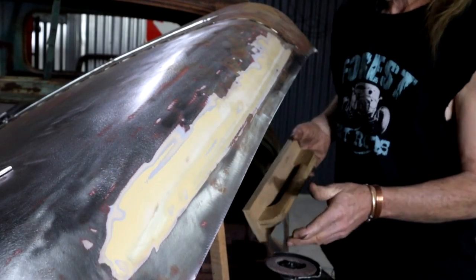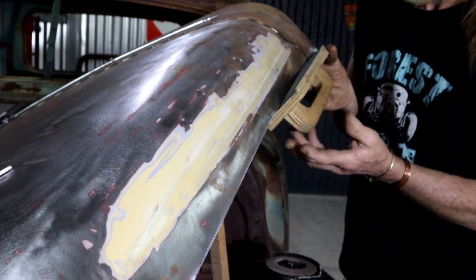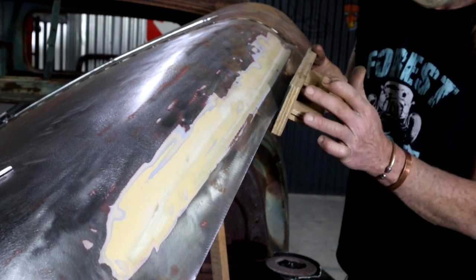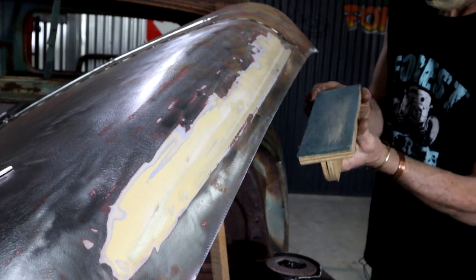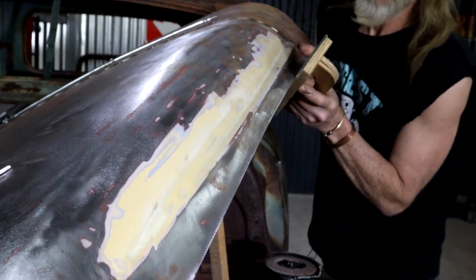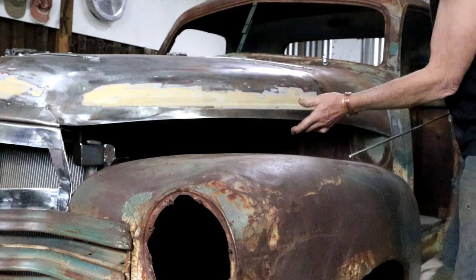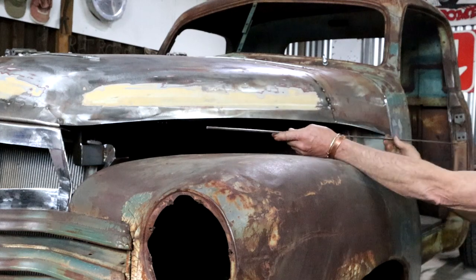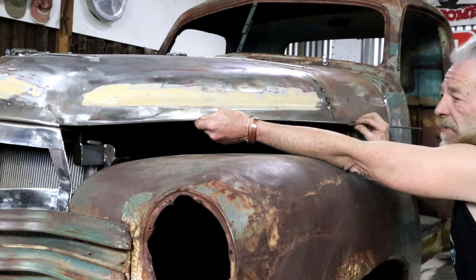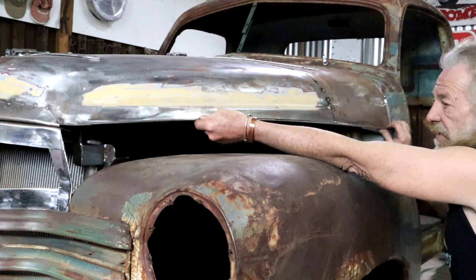This curve is starting to look much better. If you really want to fine tune this, you can make a tool like this one — I've got several of them. I've got some 60-grit sandpaper glued onto a simple base with a basic handle and now you've got a shaping tool. You can make them to any size you want. I think my curve is pretty sweet, and remember, adding the round bar will help smooth out any small discrepancies.